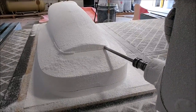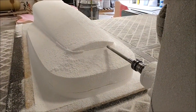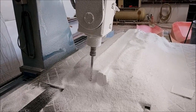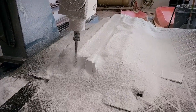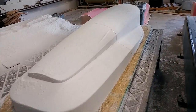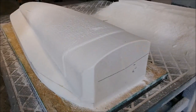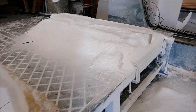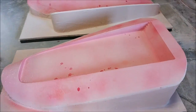Last time you also saw that I was laying up in CAD the stands or mounts for the seats. This is now running the rough cut for the rear seat mounts. There's the intake — you can see a big gouge there. When transitioning from one path to another I didn't allow enough clearance and the bit basically hit the foam, but no big deal, we can fill that.